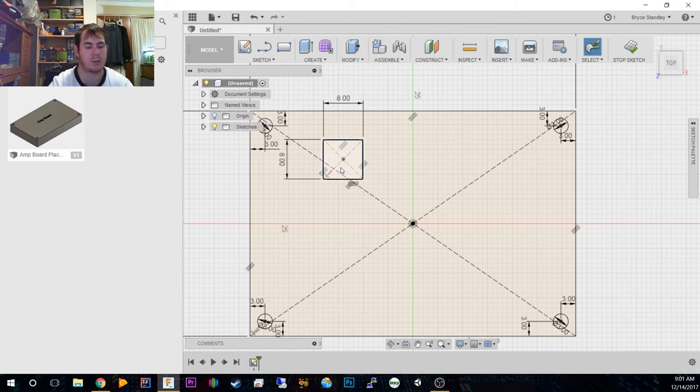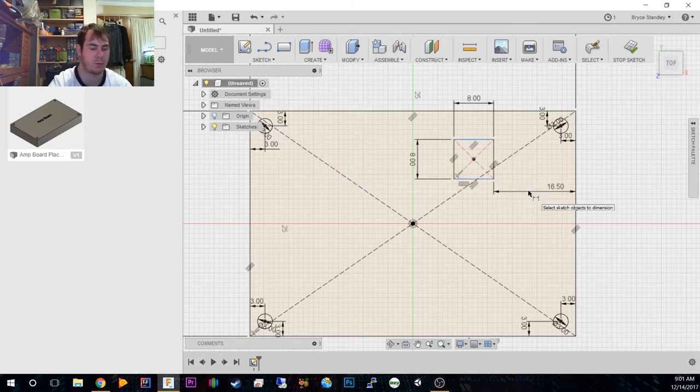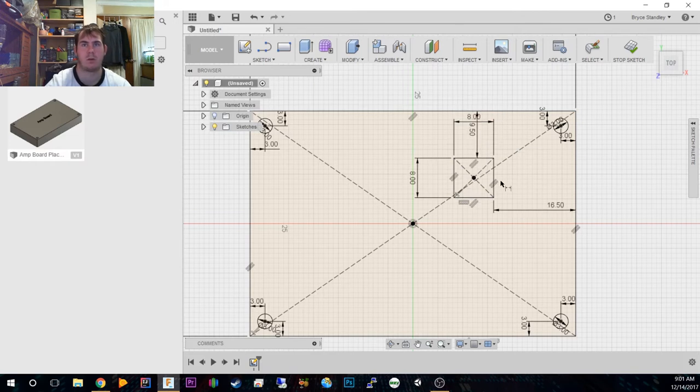Now we also want to get, give or take, the distances. So for the very far side, let's go about 16.5 millimeters from here to here. So it's 16.5. And from top to bottom, we're looking at about 9.5. When I designed this PCB, I do believe I just slapped all the tack switches in somewhat of a neat arrangement. So we are now going to...